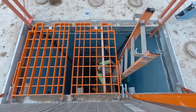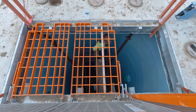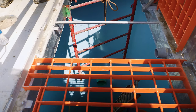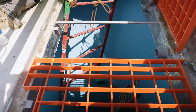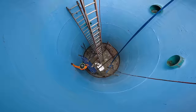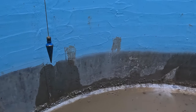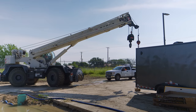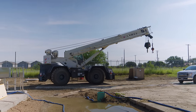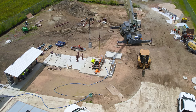The very first lines will go into the wet well, but the scaffolding inside has to be removed first. This assembly was useful to hold up the formwork while the concrete top was cast, and for the spray liners to stand on while they did their work. It gets dismantled inside the wet well, and each piece is lifted out one by one. While one crew gets the last pieces of scaffolding out, another starts laying out the locations for all the pipes using string lines. The strings help achieve nice straight lines as pipes, fittings, and valves are moved into position. Plumb lines mark locations at the bottom of the wet well directly below each of the three block-outs in the concrete lid. Finally, it's time to start installing pipes.